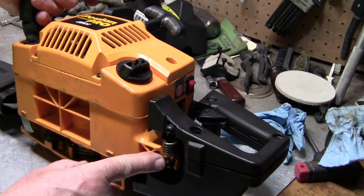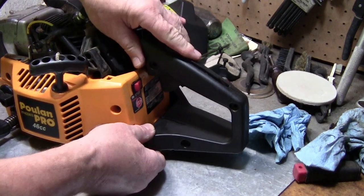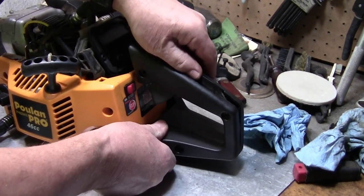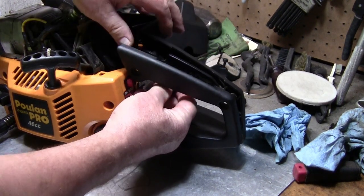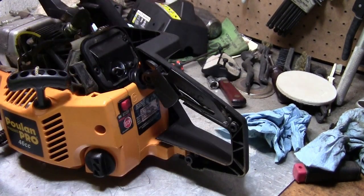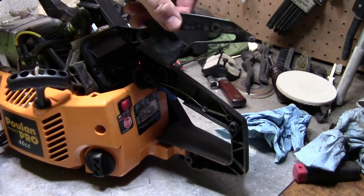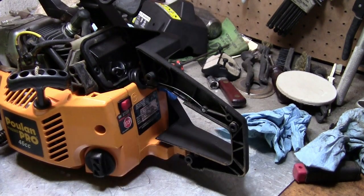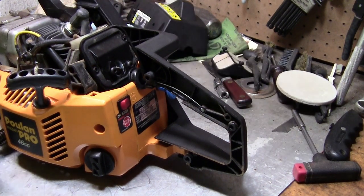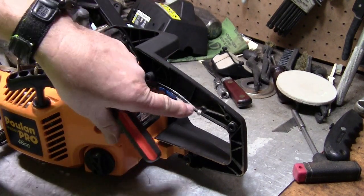I'm going to take it off right here so the spring stays on. Now this cover piece right here should come right off. Try to leave everything else in place like the trigger and all, so we'll know exactly how it goes back together. Now go ahead and remove this. Back here is the cable, so we're going to remove that as well. Take a small screwdriver and just pop it out there — that's your cable. Remember that's where it goes.